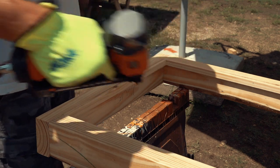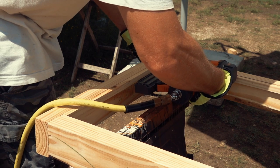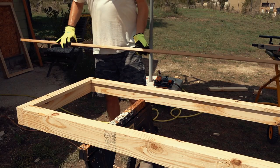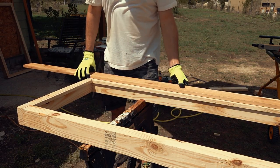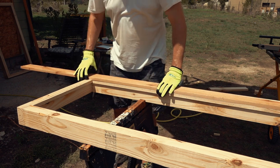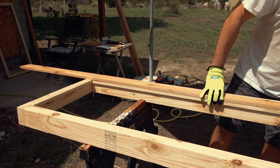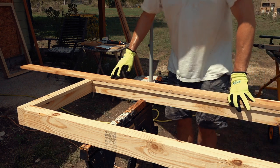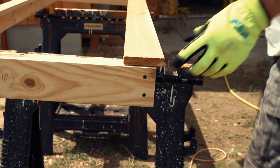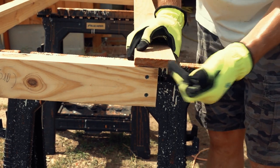These are 18-gauge, one-and-a-quarter-inch nails. I'm thinking I can just attach the trim as well — the one that goes around the outside — and then paint the whole thing. Then I can slide the whole window frame into the opening. This is western red cedar, and this trim overhangs the window frame by about this much.